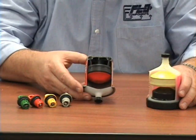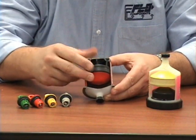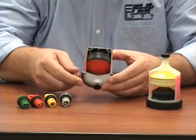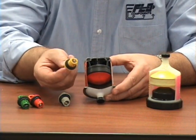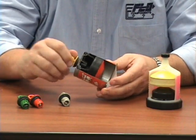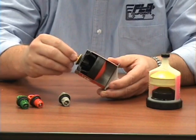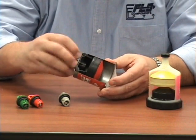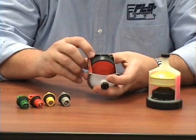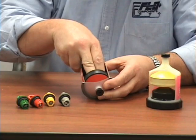With the gas charge units, they consist of a bladder full of a solution, a piston, and your lubricant on the bottom with your outlet threaded into the bearing. Using activation pellets — as you can see through the silver pellet here — they are screwed into the top of the unit until this ring breaks off. Once that happens, the pellet is dropped into the solution which generates the gas. As the gas expands, it pushes the piston down, dispensing your lubricant.